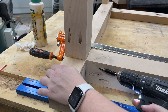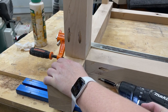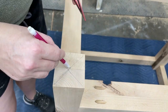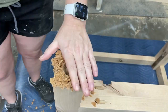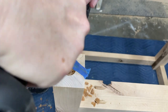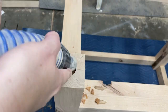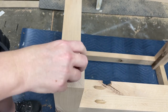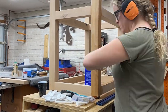After driving those last few screws into the base and getting it assembled, I always like to add feet levelers to my pieces — you never know if a client's floor is level or if they have chunky tile. I add a recess hole using a Forstner bit, then following the instructions on the feet leveler, drill about a one inch hole in there. Then you tap in their little insert nut — I don't know what you call that — and screw in the feet leveler. That way, if they don't really need it, it'll be hidden, but if they do need it, they can just untwist it down.